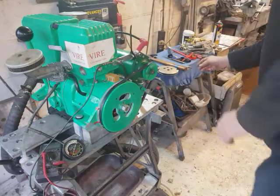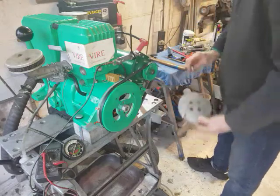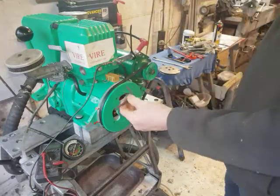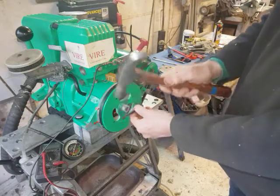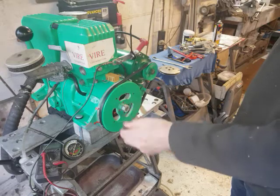I've already taken off this cover with the bolts. The technique to do that is to use a 6mm allen key and tap the end of the key round rather than turn it by hand — they'll come out quite easily.